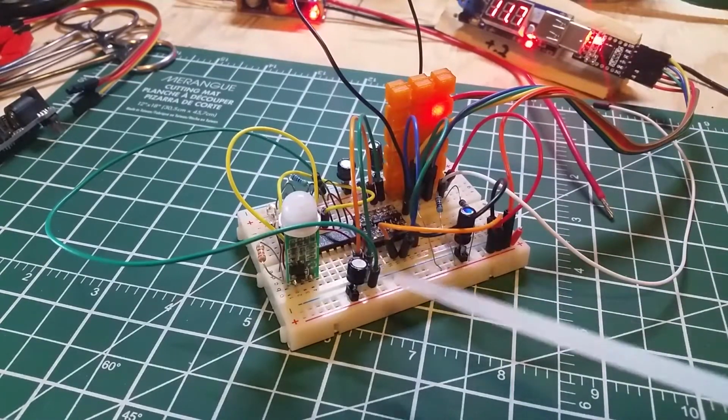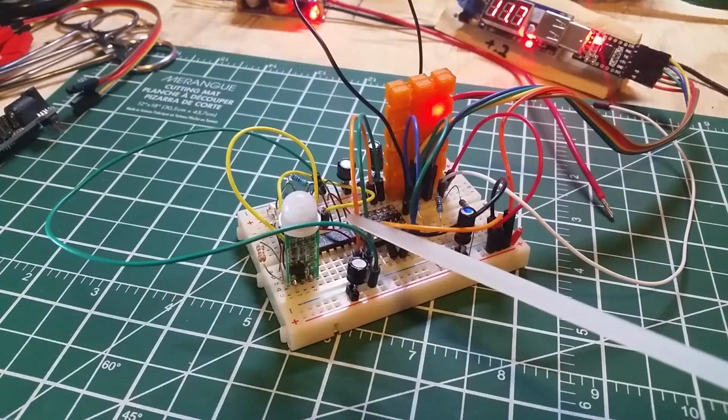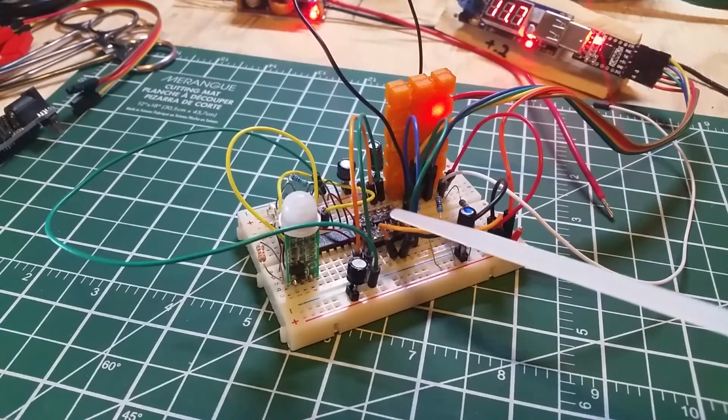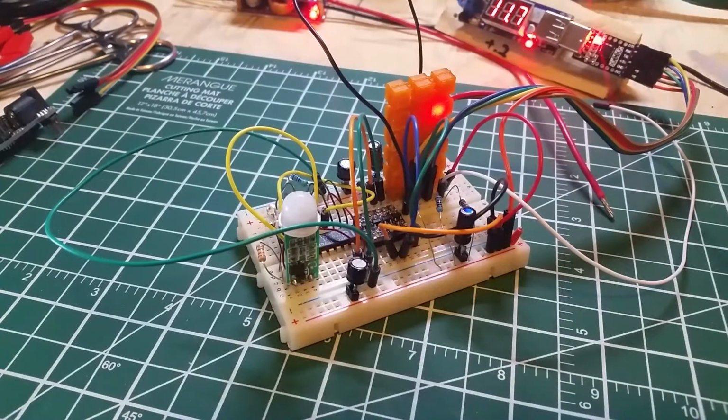But anyhow, so we have the I2C extra GPIO chip right down in there. It's just a little IC. Then we have a dual channel level shifter. I mean, obviously I2C is what I'm using it for, but really it can level shift for any purpose. I forgot the type of, I think it's CP2901 or whatever. It's a very common chip.